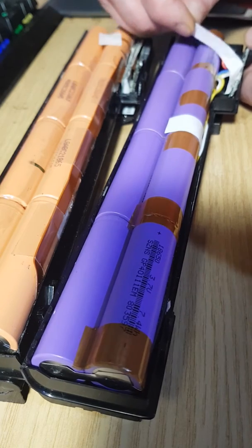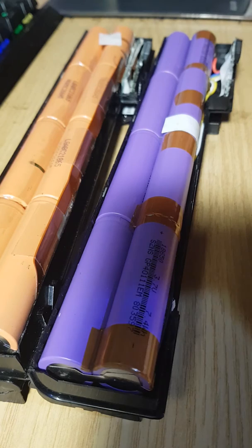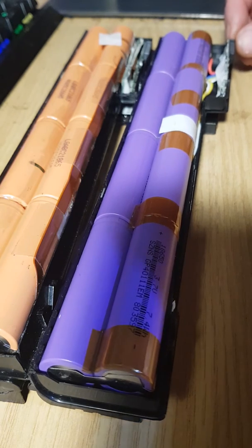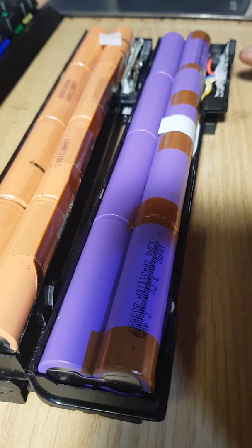But yes, there's a set of chips on the back here, which are your voltage regulators and charge regulators, and then the firmware, which obviously communicates. I believe it's an SM bus, system management bus, over 3 pins. I believe the outside ones, the two far right ones, are the ground. The very far right one is your positive, and there are 3 pins in the middle area, which are the SMBus.